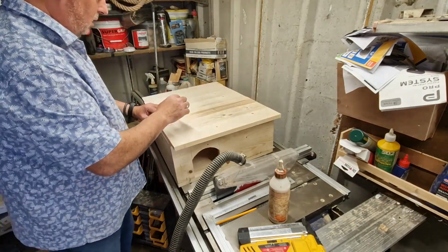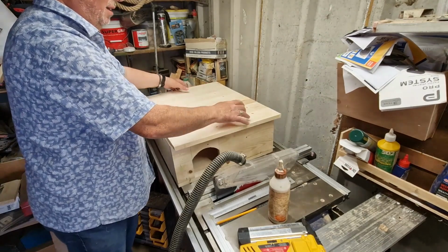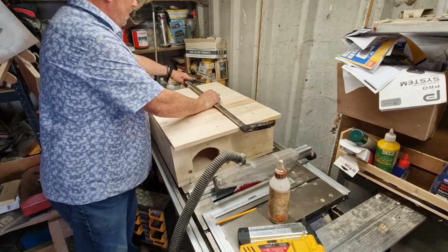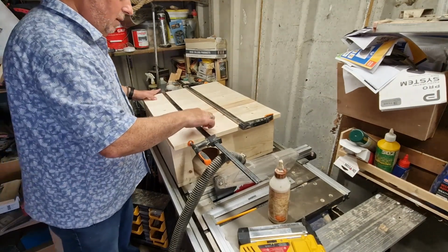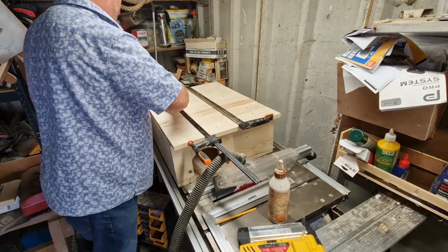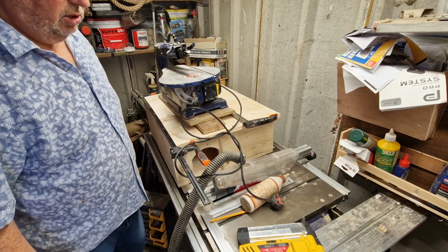Then I suggest that you get one end nice and level. And then the other end, if you cut them slightly different lengths, you can sort that out later, sanding it down, whatever you wish to do. I'm hoping these won't splay up, but we'll see as we put pressure on. And it doesn't need too much pressure to do this. Now I'm just making sure I can see squeeze out of the glue down each joint. That will make the joints waterproof. Which is fine, I'm happy with that. Just make sure they're relatively level. That should be perfect. Leave that to dry now.